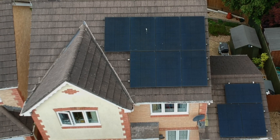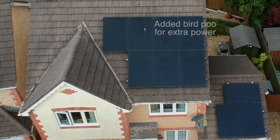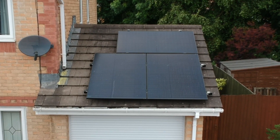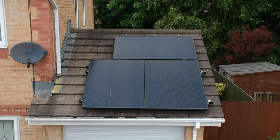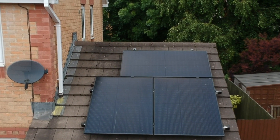Let's start with a reminder of my installation. I have 10 390-watt Trina Vertex panels mounted in a mostly south-facing direction, slightly southeast. Three of these are on the roof above the garage, so while all of the panels catch the sun early in the morning, by mid-afternoon I'm starting to get shading on the garage. To overcome this, each panel has an optimizer fitted to it to prevent that from affecting the generation of the other unshaded panels.